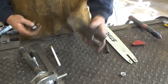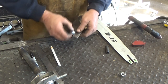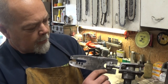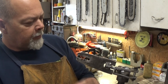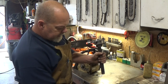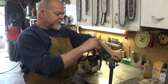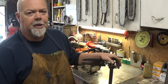Alright, I'm back. Got our three holes for our chain adjuster, and we've got our slot for our nut. Sorry about that guys, battery went dead in the camera — you really didn't miss too much. All I did was take those two nuts, put them together, and weld them against the bar. I put a good weld back here to hold everything in place. As far as the mount goes, nothing easier than a one-inch hole on top of your bench. Underneath here is a scrap piece of 4x4 that runs back about this far. I drove the hole about three-quarters of the way through — it just sticks in there. Take it, mount your chainsaw, do whatever you've got to do to it, then give it a lock in place.